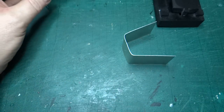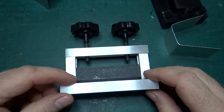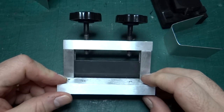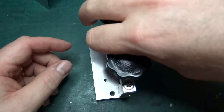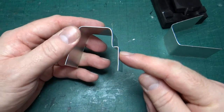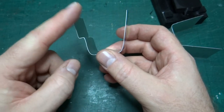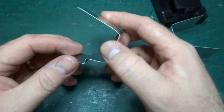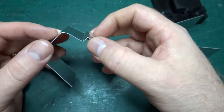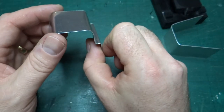Now, we also talked about the fact that I bought this miniature metal brake, which definitely folds 90 degree corners, but the problem is once you've folded one corner, you can't get another one close in to do the second one. If they were both folding the metal in the same direction to make a U-shaped piece, you could do that, but because you want to fold this one that way, push down here, this is in the way, it won't clear the part.